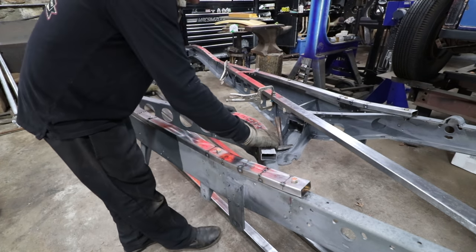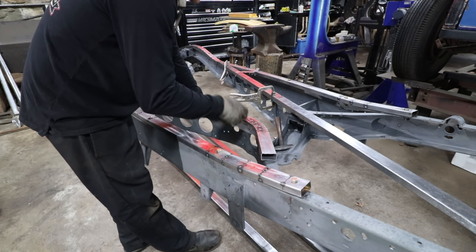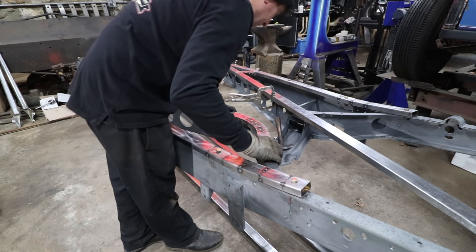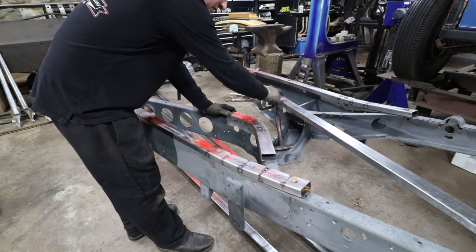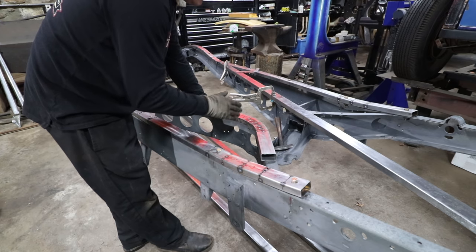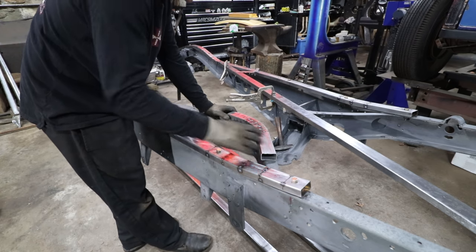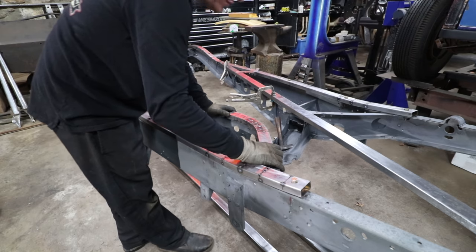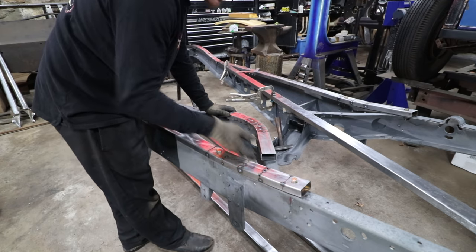Doing it on this smaller piece, I was able to quickly go back and forth and it worked out pretty nice. My cuts this time around will definitely be nicer because I'm not just making a rough piece here, and our pattern looks pretty good. So if I mark this one here at the same spot, we'll make the bends the same distance apart. Then I made multiple cuts where we pulled it together and then cut it again, another thickness of the blade. It's just a slow, controlled way that you can creep up on the bend to make it all work. But that flows real nice.